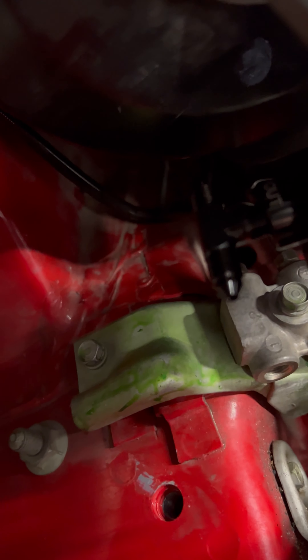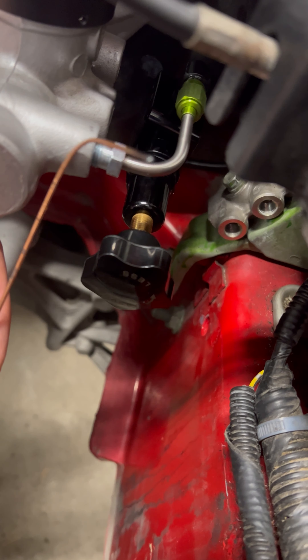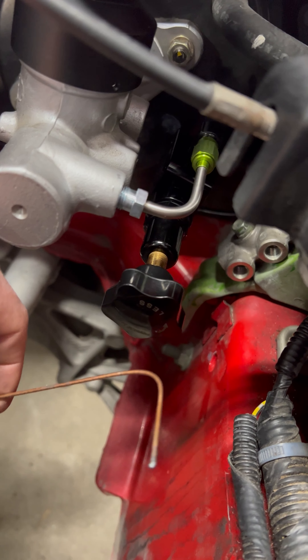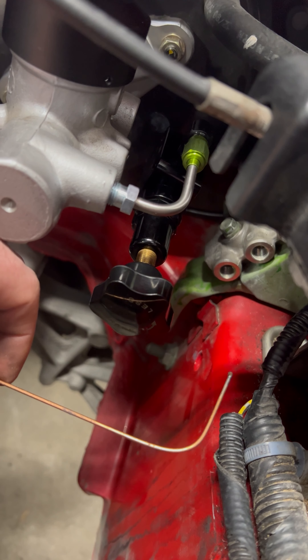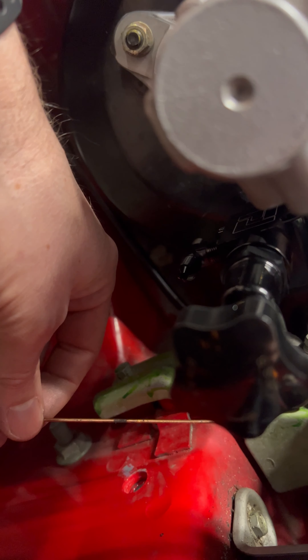I'm going to show you a little hack I like to use when jigging up hardline. Working with a whole roll of hardline in a tight space obviously doesn't work out very well. So I tend to take some type of - this is just mild steel TIG filler rod. It's strong, it's bendable, and you can basically form the shapes you need out of it and make a little stencil. So this goes into the port here, and you can see I've got a bend that's going to go down, and then we'll form the rest of the bends to plumb to the back port of the T.